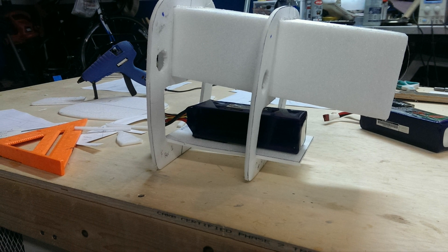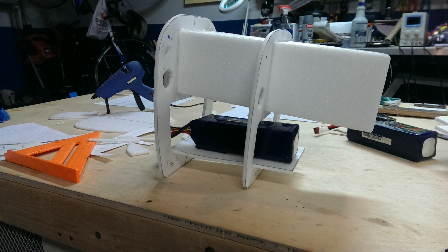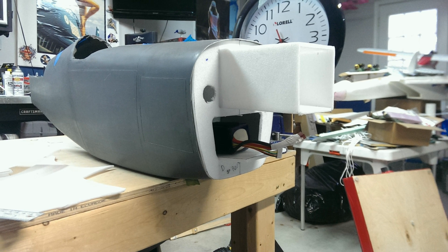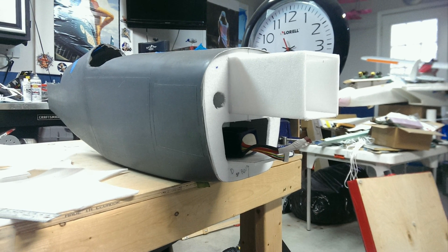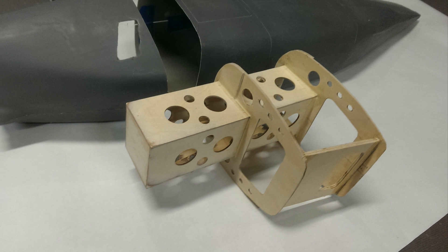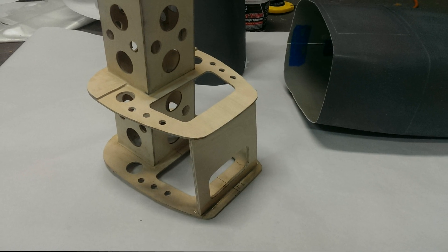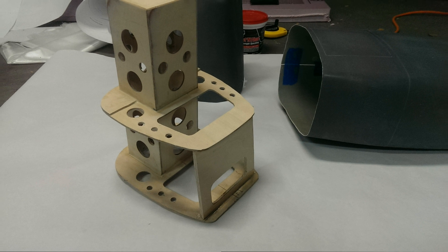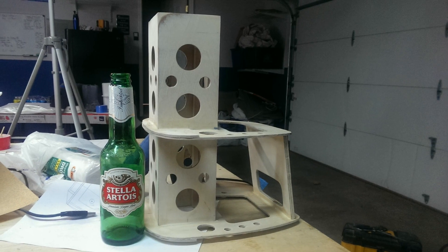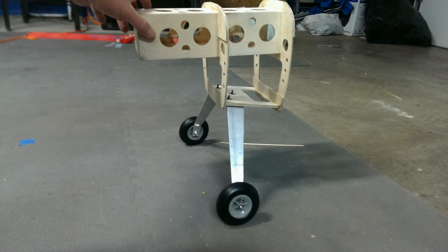Starting at the firewall, I mocked up the main structure that would handle most of the flight loads. This includes the motor mount, main gear mount, cabane mounts, and the likely location of the battery and electronics. Once I was happy with the foam mock-up, I cut the parts from aircraft grade plywood. Most of the plywood is 1/8 inch, with 1/4 inch plywood used at the mount points for the cabanes and main gear. Two layers of 1/4 inch plywood were also used in the front of the motor box to strengthen the attachment area for the motor standoffs.